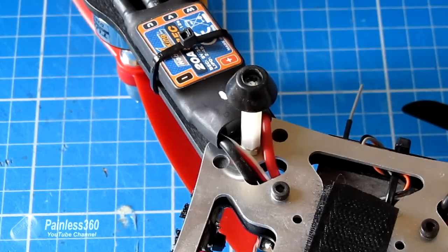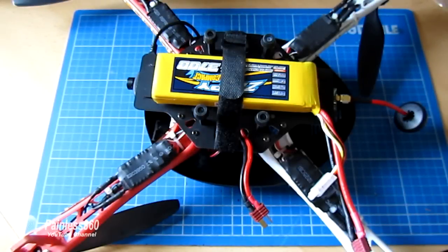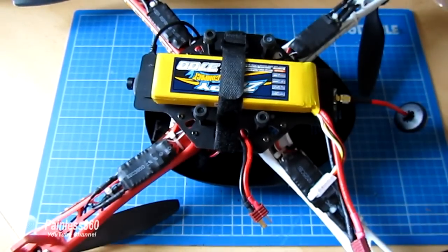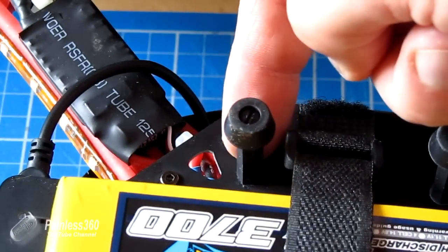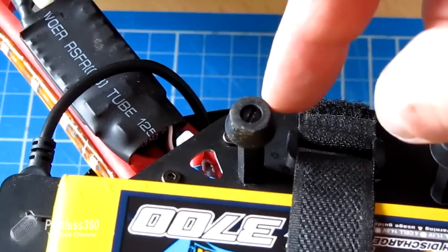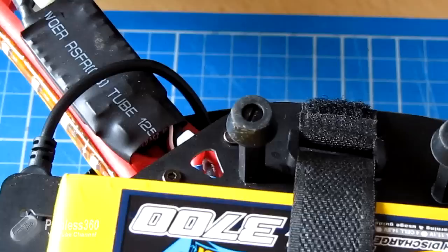Let me show you what it looks like on the one I've made. Here we're looking at the bottom of the large quad I used recently for my motor prop comparison video — the legs are just protecting the battery at the bottom. Zooming in, all I've done is drilled a three millimeter hole into the bottom plate, used a 25mm standoff and a rubber foot, held in place with a nylon screw.